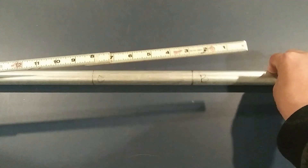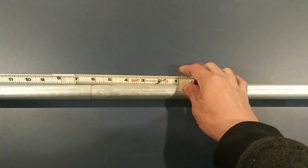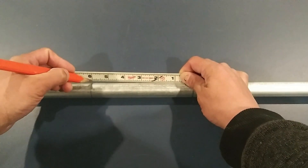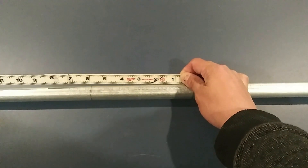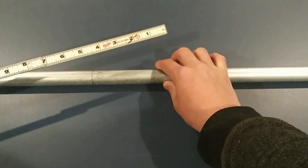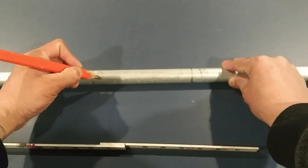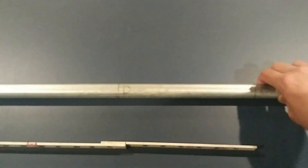For the video I went with six inches. So I came and I marked my pipe at six inches from my second mark — this is my C mark, my first mark for my second offset. I called it C. So now we're going to finish off our second offset.